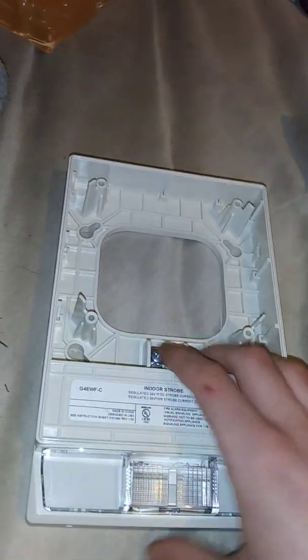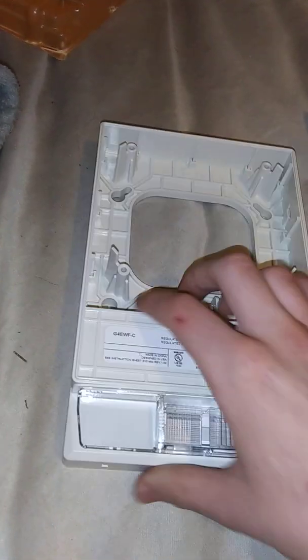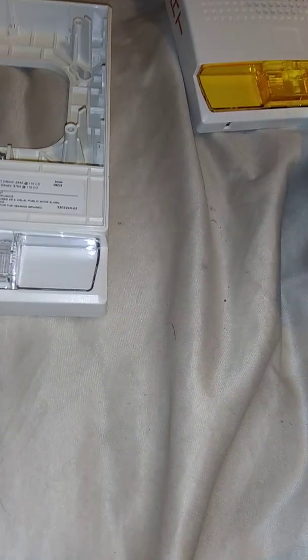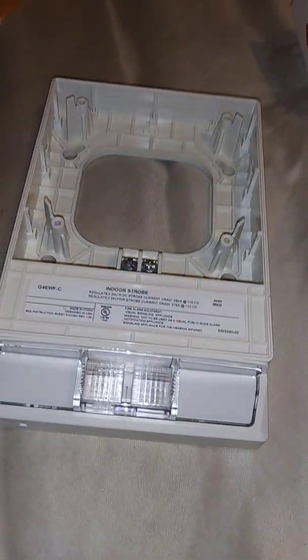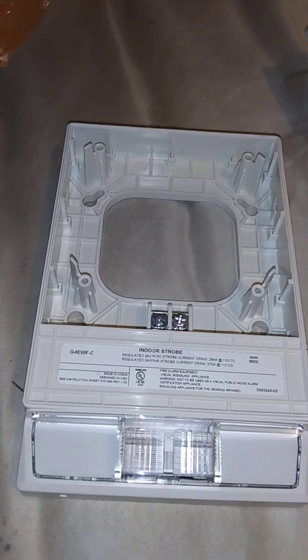But however, my opinion about the ABCD on clear lens is that for the clear lens, it should only have the regular 15, 30, 75, 110. The ABCD should only be for the colored lenses, like I said, because of the candela output degrade that the colored lenses can actually do to the actual light outputs.